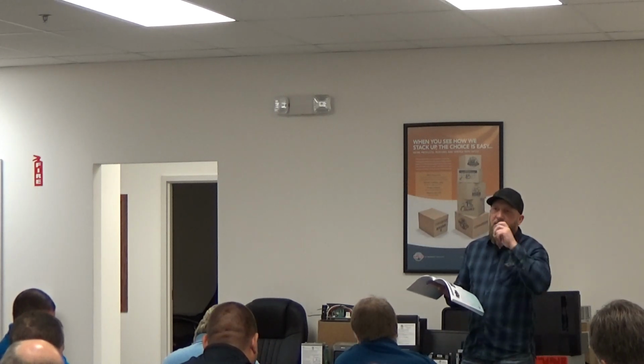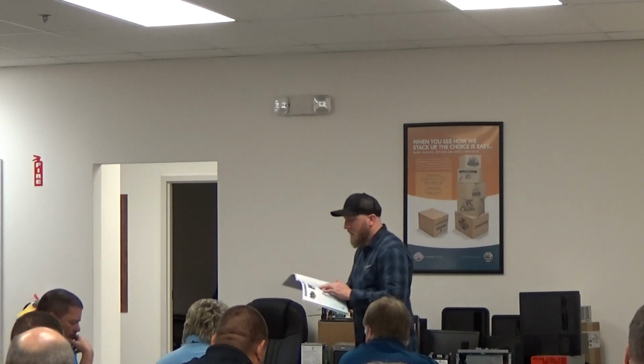Not all of these are interchangeable, so 55 and below, they are interchangeable. So a 35 will fit in a 55, a 55 will fit in a 35, and the 65 and 75 will fit in each other's, but not in the 55 or below. So 55 and below, you can interchange those. 65 and 75 can only be interchanged with themselves if you wanted to. I'm not sure why you would, but if the dealer only has a 75 on his shelf and they have a 65, you can put the 75 in, or vice versa. Just because the 65 and 75 case is a lot larger than the 55 case, so they do not fit.